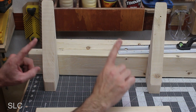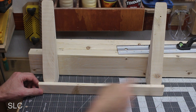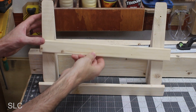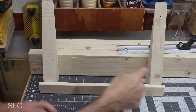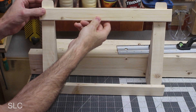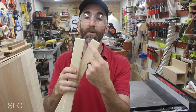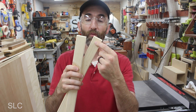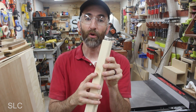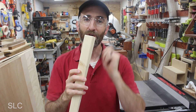First, take the feet and lay them pointing straight up, then place the first strip so there's about a half-inch overhang on each side. Proceed to place the others the same way — that way, if the distance between the bottom and top is a little different, you won't be able to tell easily. If you're using screws, this is the time to pre-drill all the holes, making sure they're nice and uniform across the strip and from where the footer will sit. I'm going to use a drill press to make quick work of this, but you can do it by hand if you measure carefully.